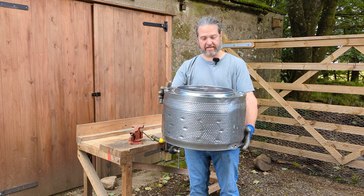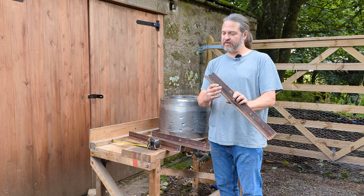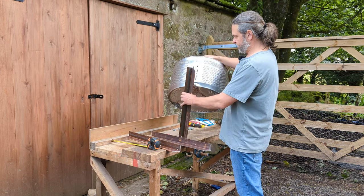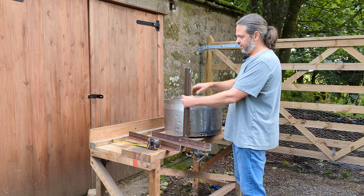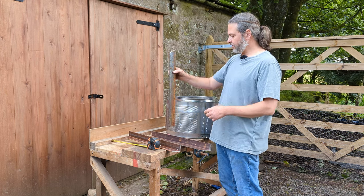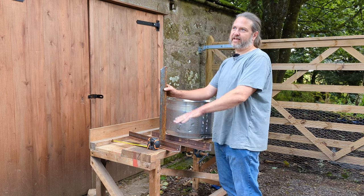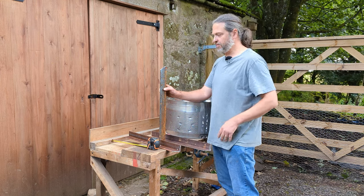We now need to affix some legs. I've cut these three legs from a bit of scrap metal we had from a previous project. The idea is to bolt the three legs onto the drum. I've cut the sharp angle off so it won't be quite as aggressive if you knock it with your knee. We're going to have it so that the drum sits about 35 centimeters or 14 inches from the ground — it gets the heat higher to where your body is and also gets it up so you don't burn the grass or whatever else might be under it.